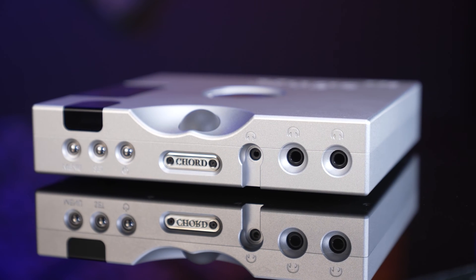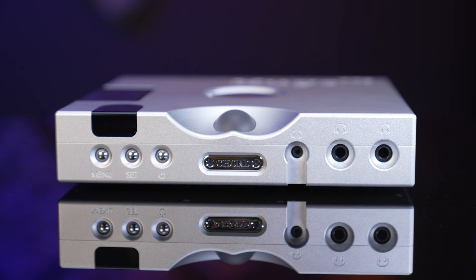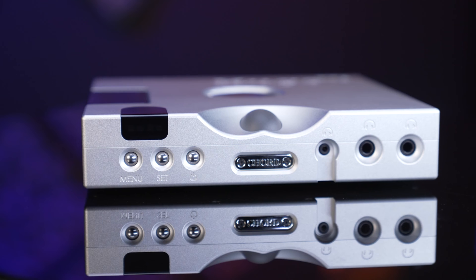Now that we've located it in the line, let's talk a little bit about what makes it special. There's a lot of functionality here that's not on offer on the lower-end DACs. There's a headphone amplifier which puts out 6 watts or more in Class A — a very, very powerful headphone amplifier. There are also selectable crossfeed options for headphones. The Hugo TT2 has long been known in the headphone realm as a fantastic option. The Dan Clark headphones, like the Expanse and the Ether 2, have paired really well with this, and it will even power some of the harder-to-drive HiFiMan headphones really well.